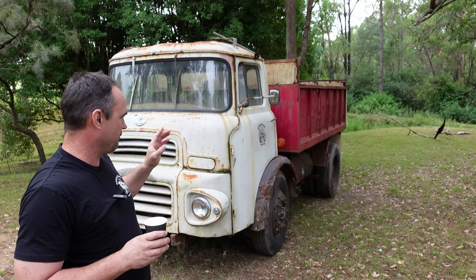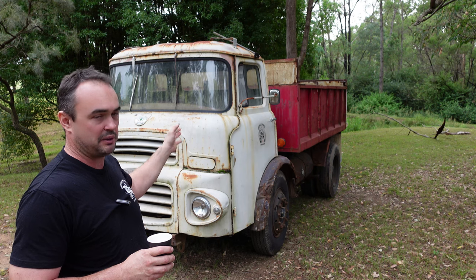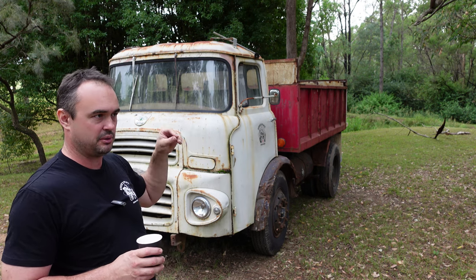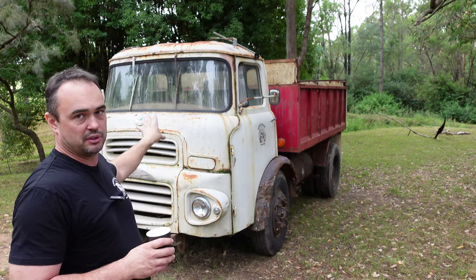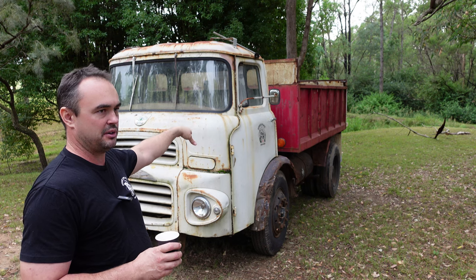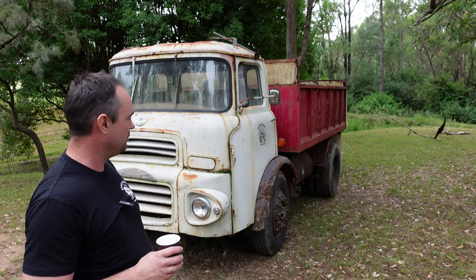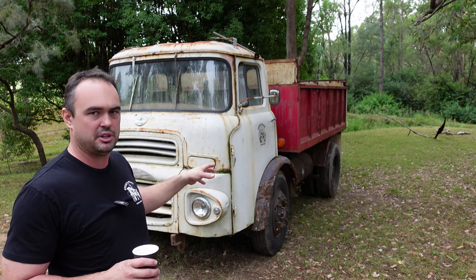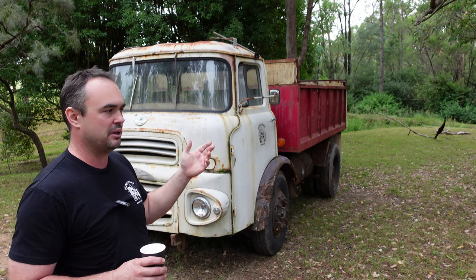So for those of you who watched the one with the radiator, where I did the radiator, done the water pump and changed the fuel filters, it's been hard to start since then. So I changed the seals on the filter itself, but there's a separator halfway down the chassis that the seals are a bit hard. So I'm suspecting it's sucking air there, but we might just pressurize the tank and see if it does leak there. If not, I don't know. It could be a lift pump. It could be a number of things.